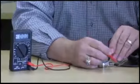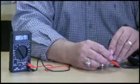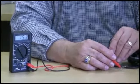The next step would be, if the light is on but your antenna or preamplifier is not working, put your paper clip in your connector that says antenna, ANT. Once again, the threads or the case is your negative lead. The voltmeter should be reading plus 15 to 15.5 volts DC. There is a regulator in the little power injector that takes the 18 to 27 volts and regulates it to a plus 15 going up to the antenna. We have determined that the transformer, the jumper cable, and the power injector are giving us our plus 15 volts out. As you notice, the LED is lit.